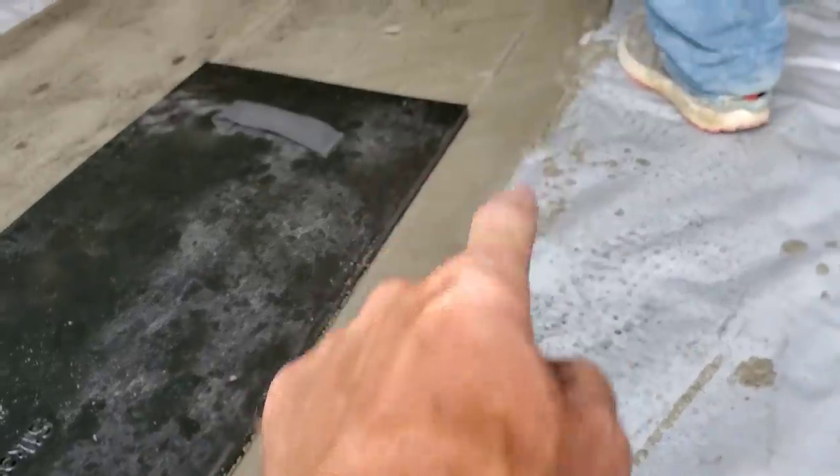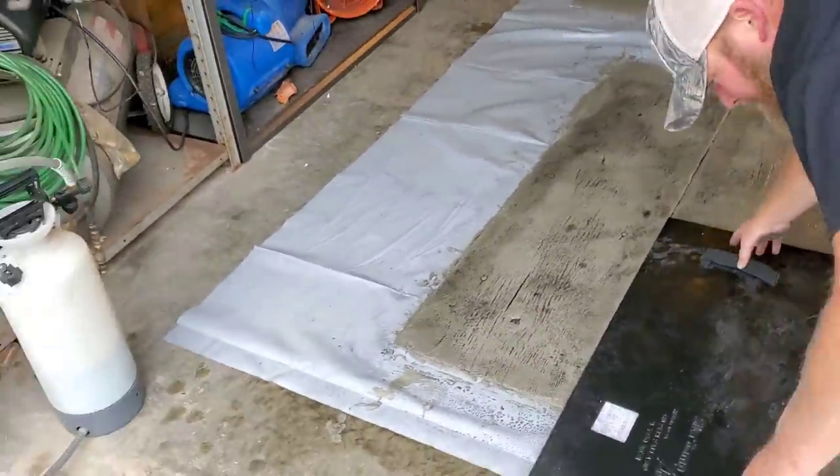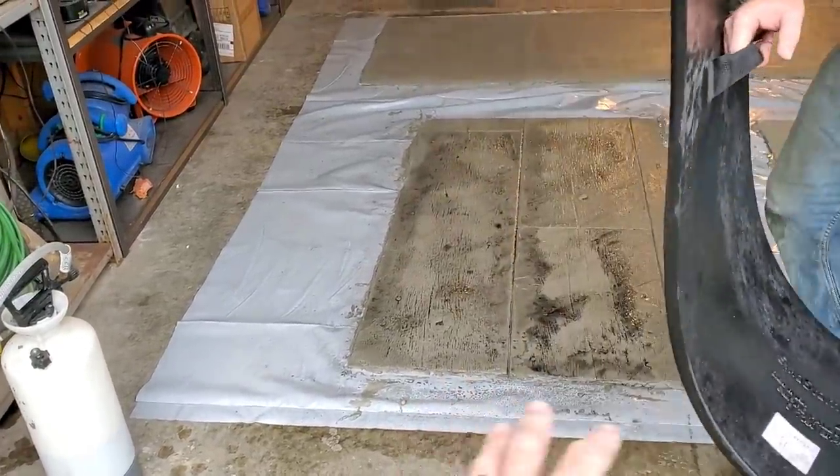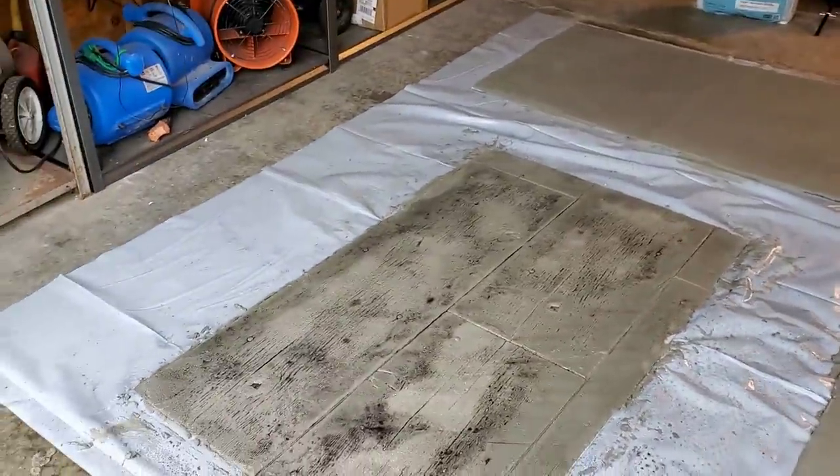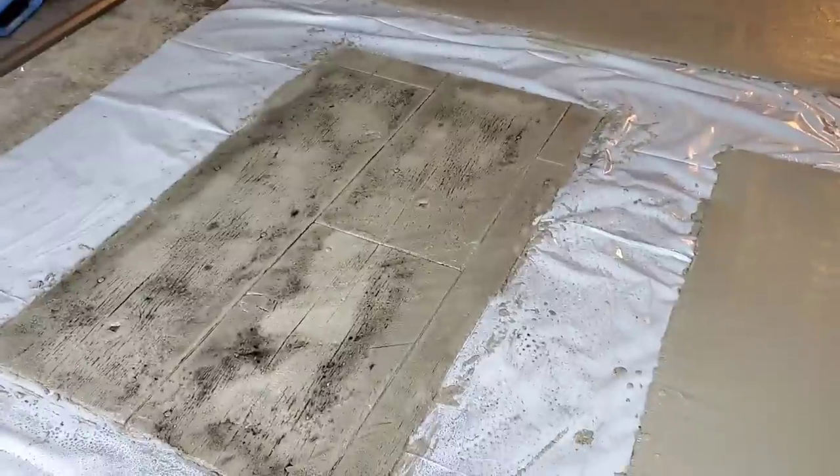You can see the wood grain texture in there — it's got really good wood grain texture. The release — putting the black charcoal release inside and mixing it with a clear release — gives us that antique-ish effect. That's going to dry like that and then we'll wash it off, clean it with some water, seal it, and that gives your barn boards a little bit more of a realistic effect. On this one, we used a clear release, and we're going to teak wash this one with an antiquing wash afterwards. So we've got two samples of the barn board done, and we're going to use the roller on that one and then the rock texture on these two — one with the pigmented release and one with the clear release.